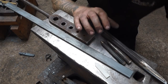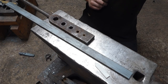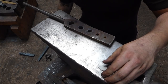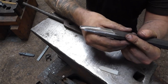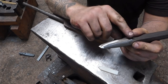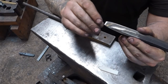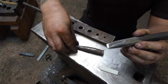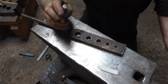Whilst I wait for the punches to cool down, let's have a little chat about what we're going to do to punch the hole for the bottle opener. In the other two videos I didn't punch the hole — one was a wrap and the other was a bend. This one we're going to use a slitting punch. It's an eight-sided starting stock that comes down to a taper, a little bit like a cross between the center punch and the chisel. At the end it has a very thin slit, and that allows us to remove the smallest amount of material, giving us the greatest amount of swell. When we run these drifts through in combination with this bolster, that'll give us a nice round 16mm hole which I'll be able to slide over the end of the bick.